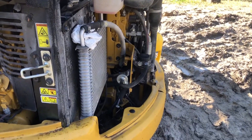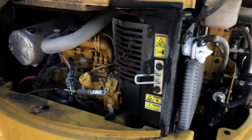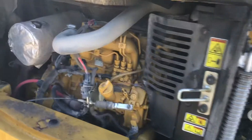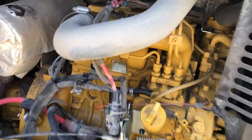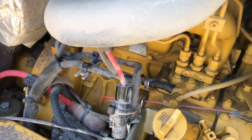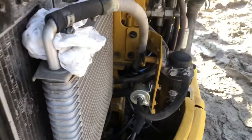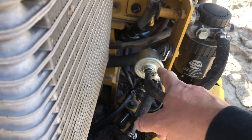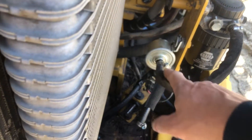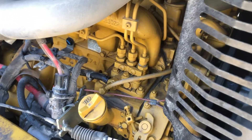We're back. I've got the excavator opened up and I can see what he's talking about - he's not getting any fuel to his primary high-pressure pump. I broke the line loose and turned the key on. What that does is actuate this little lift pump right here - it pulls fuel in from the filter and runs through some lines back around here at low pressure to feed the high-pressure pump.